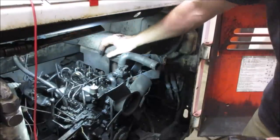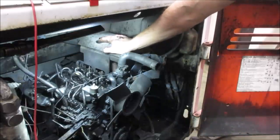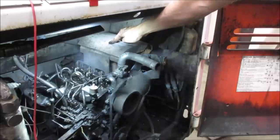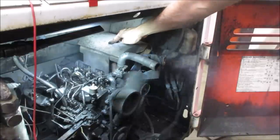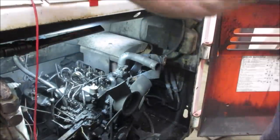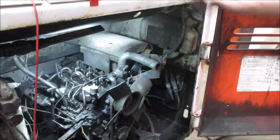Let's do a little probe of the valves. That one's got excess clearance, that one's got decent clearance, that one's already down, that one's got play. They all seem to have play. This one and this one we have to check — let's bump it over a little. That one's fine, that one's fine — so they all got play. Got a lot of blow-by — all that coming out of there is compression leaking around the rings and going down to the bottom of the cylinder and out through the crankcase. Yeah, I think we're starting to find what our problem is. Fortunately, I kind of paid around what you would pay for one that needs a motor — maybe a little too much. I'm not confirming that yet.